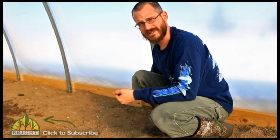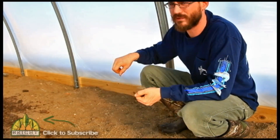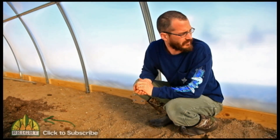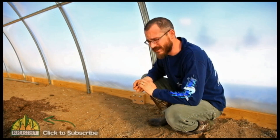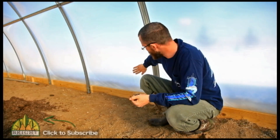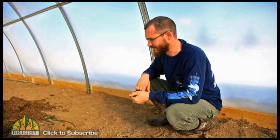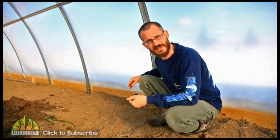On the inside we cut a chunk of two-by-six and used carriage bolts with nuts and washers to tie the baseboards together and pull them tight. You're never going to have a perfectly straight baseboard from one end to the other, so the trick is to pull them together so the wiggle wire can follow the contour of the greenhouse down the length of it. We've also got our plastic on, secured with wiggle wire channel. Let's go outside to the north side — the south side is covered in snow — and I'll show you the wiggle wire.